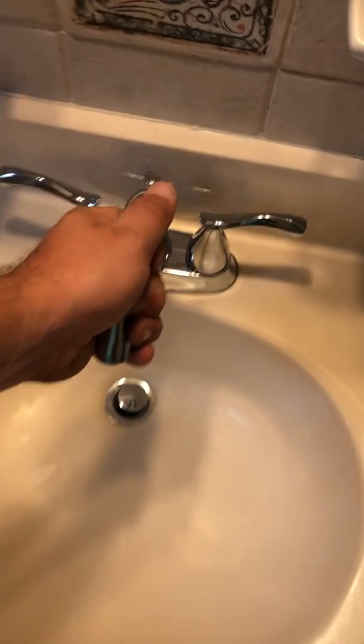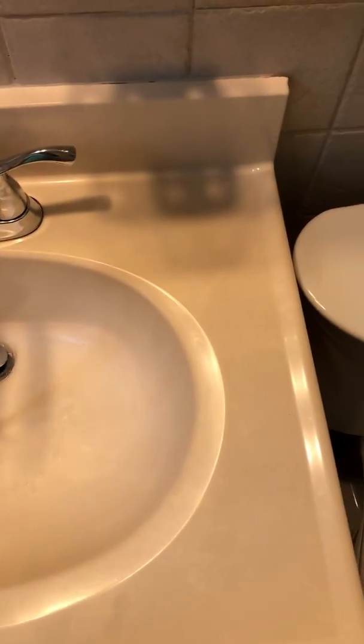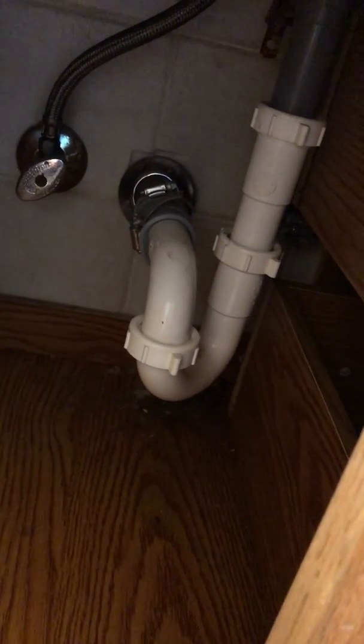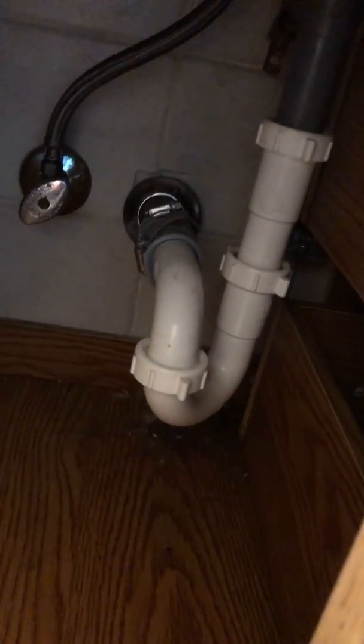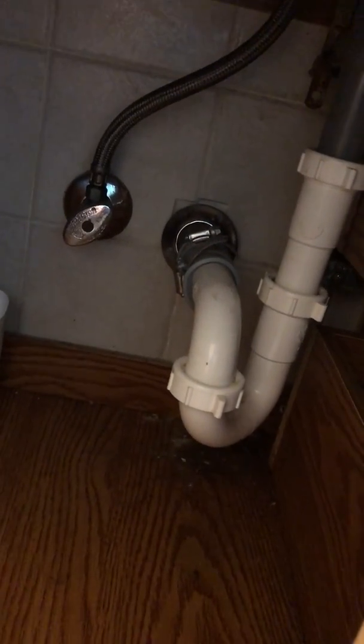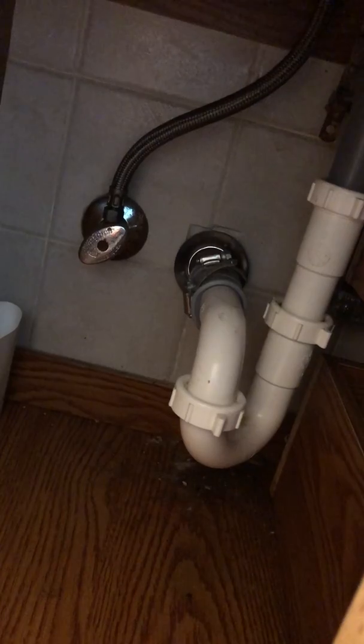All right. Again, we're going to check our sink. Faucet's on tight. We'll run the hot water here, testing to make sure the water heater is producing hot water. Also, when you're going to test the hot water, make sure that you check the electrical panel. When a home is vacant, like the one that we're inspecting, homeowners will turn off the water heater to save some money. I always recommend turning off the water heater when the home's not in use.